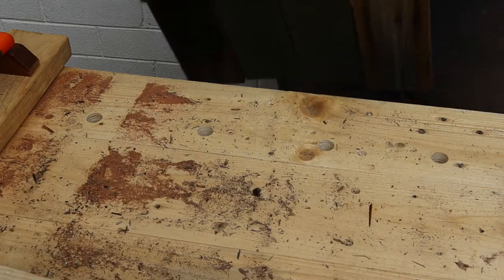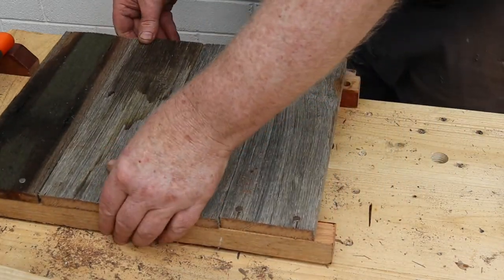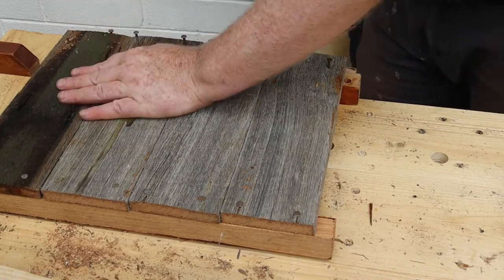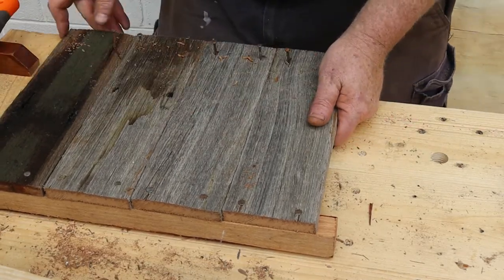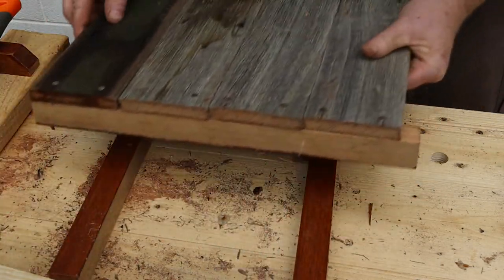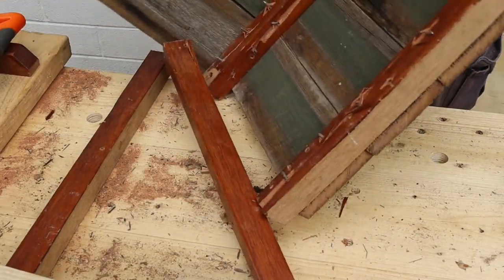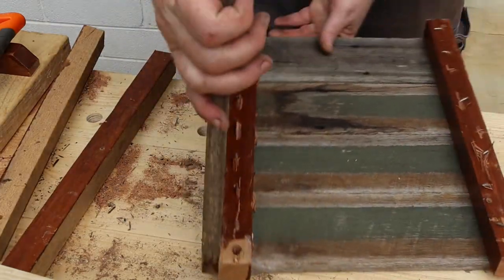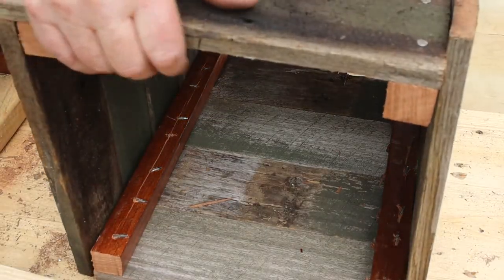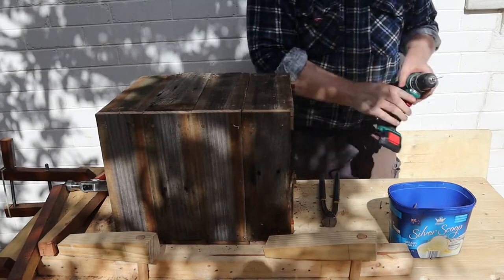Once our side panels are complete we'll join pairs of them together. Lay the first panel over the edge of the workbench against the jig, then lay the second panel on top of it, and drill and nail it as before. I'll use a couple of spare corner blocks to protect the workbench top here as well. These nail ends will also need to be clinched over like we did before. Once you've assembled the two halves of your box, fit them together, drill holes through the palings into the corner blocks, then hammer in the nails.